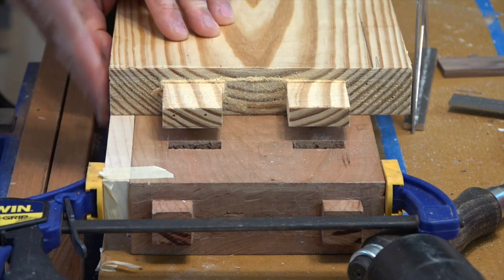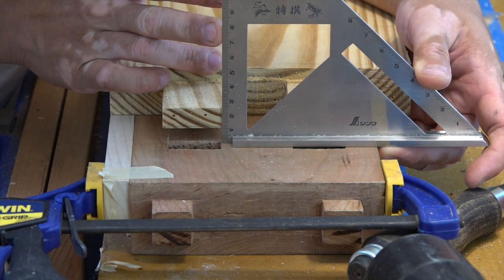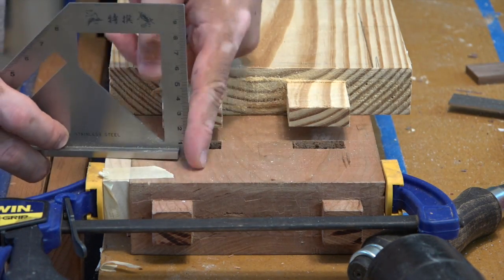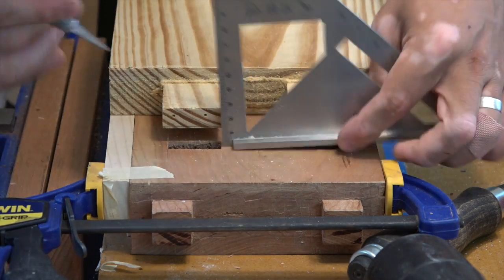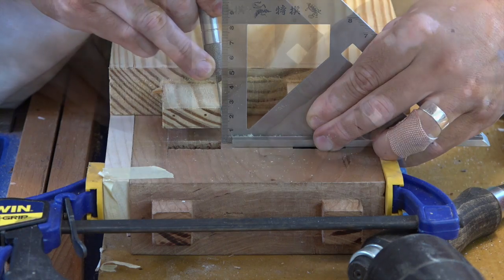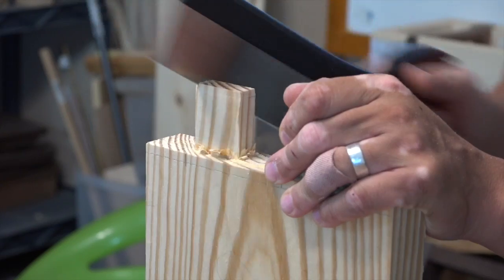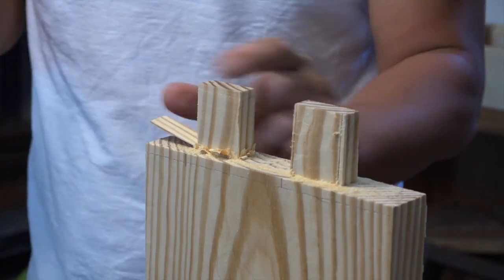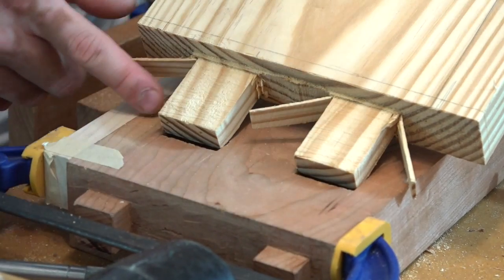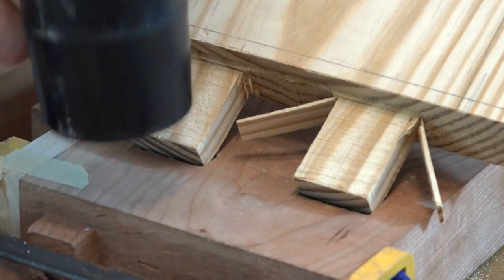So here's the offset piece, and this is where it's aligned up together. You can probably tell that the tenon is big on both sides — this side by about a 16th of an inch, and this side probably close to about an 8th of an inch. So I'm going to use this square shape to mark the position of where the mortise is aligned with the tenon. I want to make sure I'm marking this a little bit bigger.